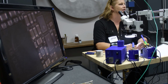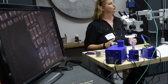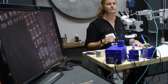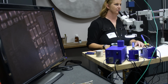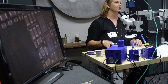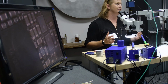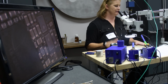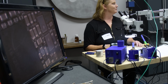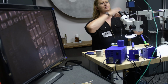So how important is the aorta? Definitely important. Now, if we actually have a short to ground on the VCC main, the main power rail, then that's a definite problem. That's going to be why the thing's not going to turn on. You can't have zero resistance to ground on the aorta. You can't have a hole in your aorta when it's trying to pump blood. It's just going to sit there and bleed out. That's a big problem. And so if we actually had a short on that power line, then we would definitely want to find out why and see if we could clear it.